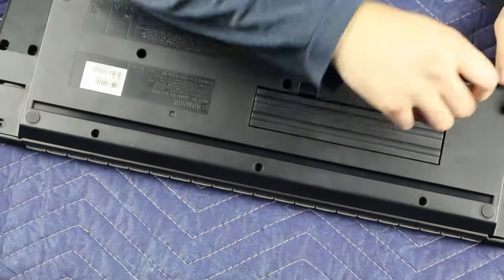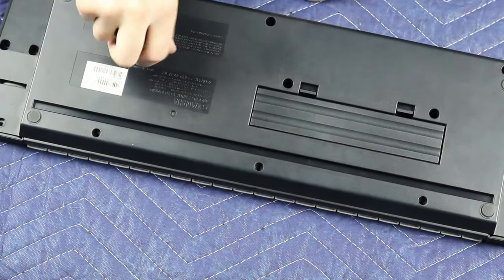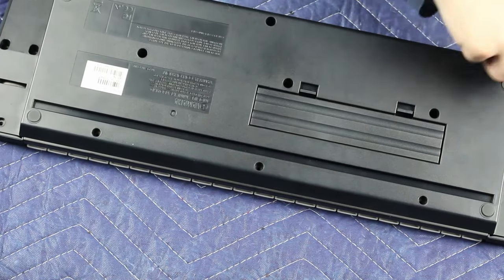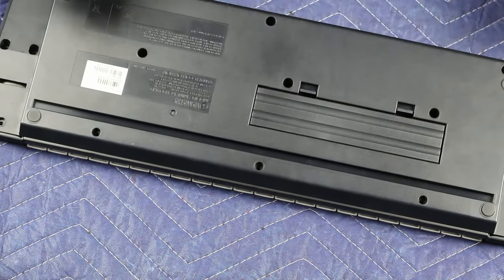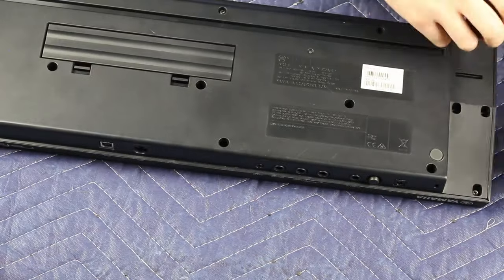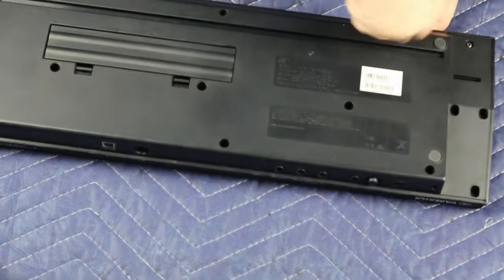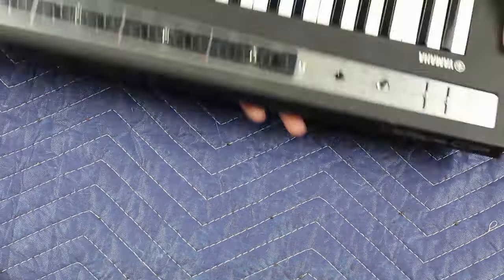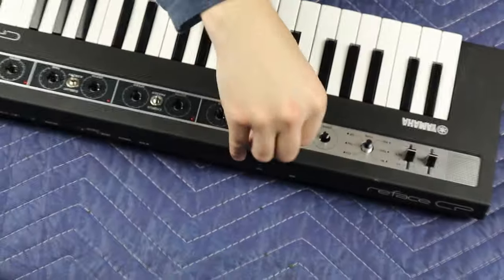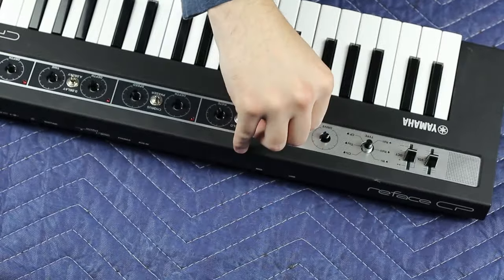The three long black screws go in the middle. The three silver screws go in the rear toward the output jacks. And all the rest go everywhere else. Replace all the washers, nuts, knobs, and slider caps — for the washers, make sure the nice side is facing up. Snug up those nuts but don't over-tighten.